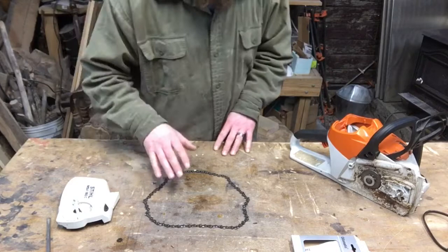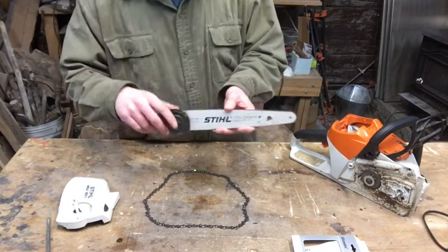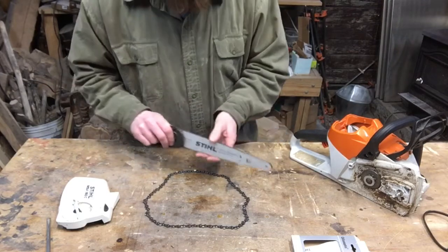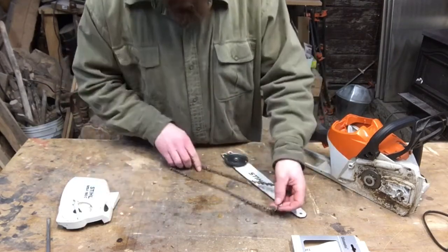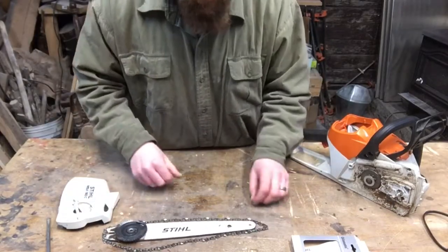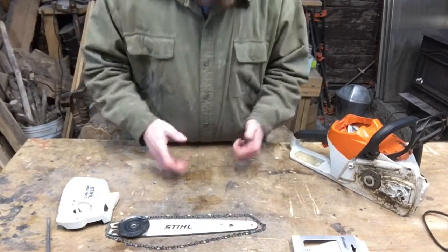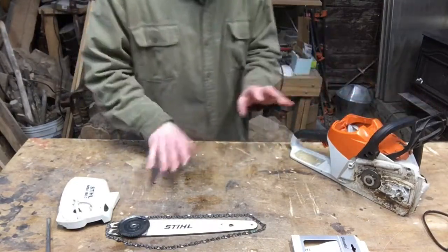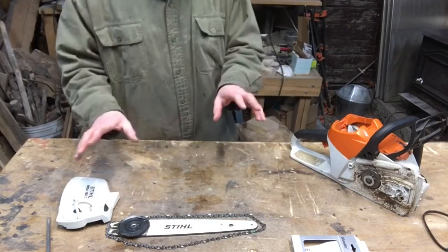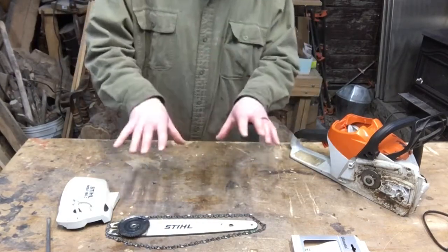Alright, we've got the chain all set. We want to make sure that the chain goes on the bar the correct way. This is how the bar sits on the saw — motor sits here. So when this spins, it comes around this way to cut. You're cutting this way, so your teeth are pulling that way. Go ahead and look at the chain and line it up. When you're looking at this chain, you'll have these teeth that are slanted back and they're grooved in. This is for someone who's got this neat saw for doing some work in their yard and is thinking about putting a chain on themselves.